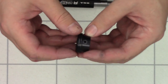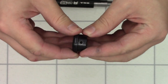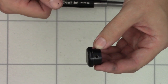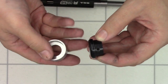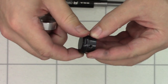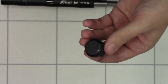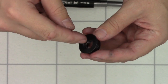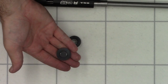With the back cap off we see this anti-tamper cap fitted on the end here. This is normally Loctited and done up real tight from the factory. To get mine off I removed it from the rifle, used a hot air gun to heat it up and break the Loctite, then made a little split collet to fit over the back that I could clamp in the vice — that gripped the outer part nice and tightly and then we could undo it. Mine's loose now and just comes off nice and easily. There is also a hammer spring adjuster in the back which is just split, so you can use a big flat-bladed screwdriver to adjust it as needed.